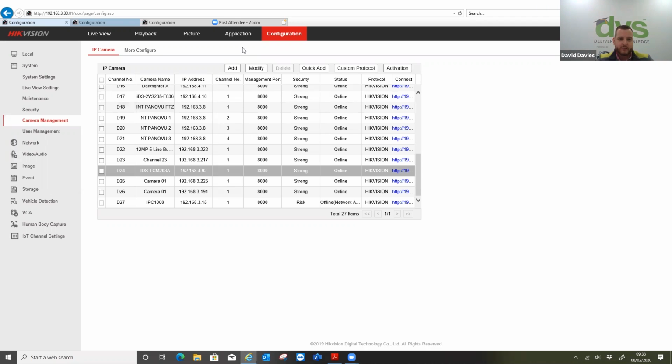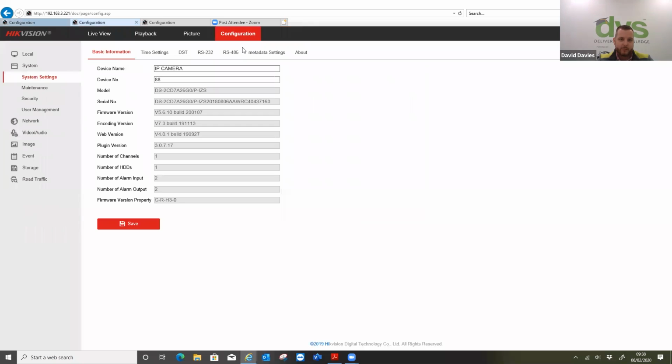Moving straight on to the product itself, if I web browse into the camera, you'll see they're web-based products. So we put them on the network, they're PoE, PoE Plus. We do them in 2 lens sizes, and that's in both the 7 line, the older 4 line, and the IDS TCM, 2 different lens size variants. The most popular is the 8 to 32mm lens. That gives us a longer read distance of up to 35 meters from the camera point.